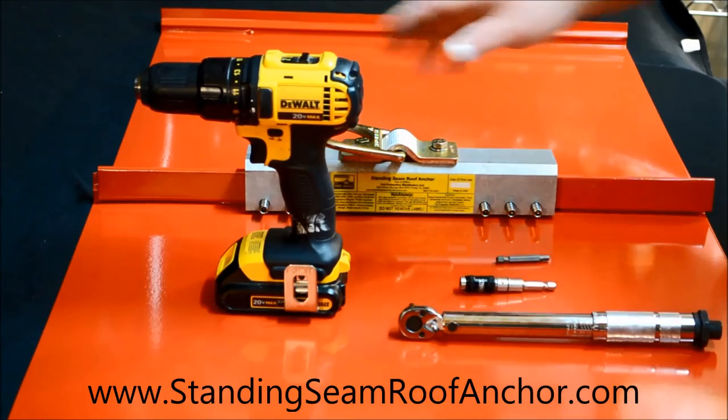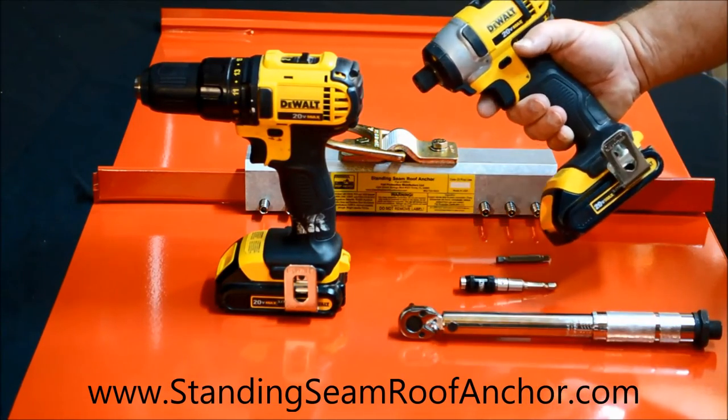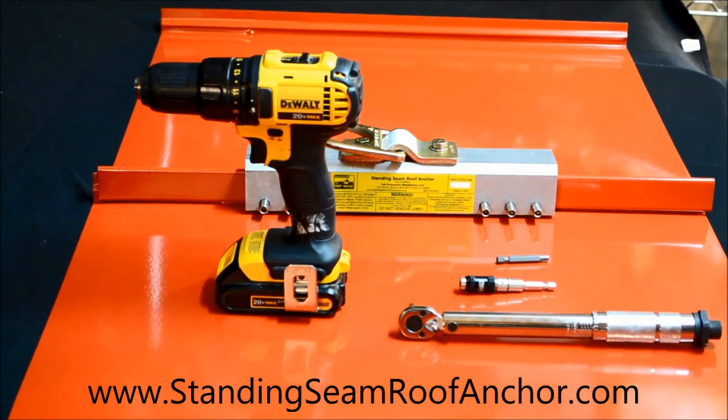Your gun's going to be a little bit different. You could also use an impact gun if all you have is that. But just remember, impact guns don't have clutches. And if you stay on that trigger, it will drive that screw way over 90 inch pounds, which can damage the seam. So we don't want that. A screw gun with a clutch is the best way to go, because you can set it so that you don't over torque it.